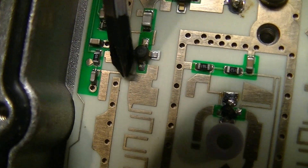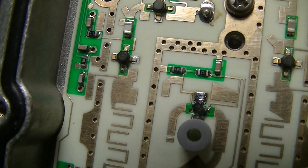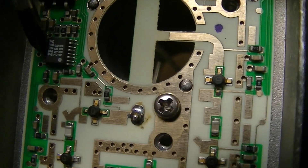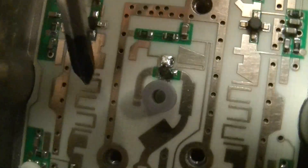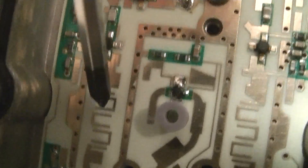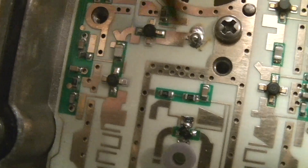Each of these has very thin traces which, at these frequencies, are fairly effective inductors — just to keep the micro signals off of the FET control lines to avoid screwing up the device. Each one has at least one stage of passive RC filtering. These are just DC blocking capacitors, because this particular filter stage provides inherent DC blocking, but these go straight from one thing to the other so they need the DC blocking caps.